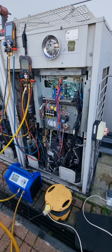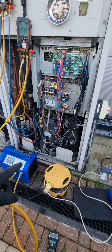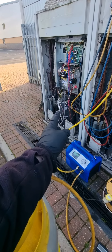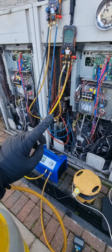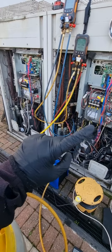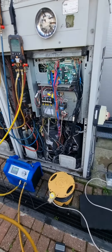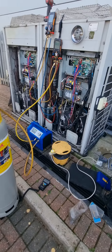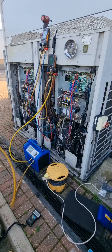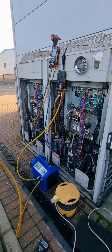It's a master-slave system — both compressors have failed. The slave inverter compressor failed, and I think the inverter has failed in one of the other units as well, can't remember which one. It's an old unit that's pretty much worked flawlessly all this time, but it's got to the point where components are quite hard to get hold of.